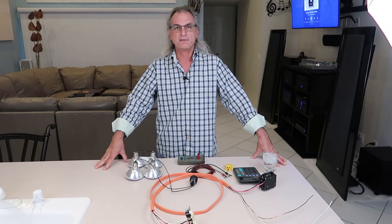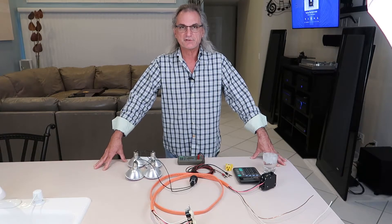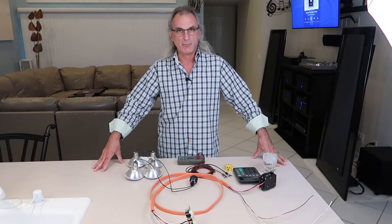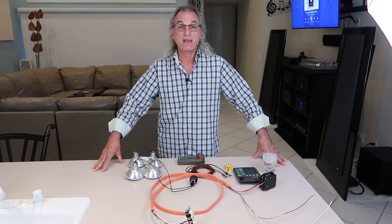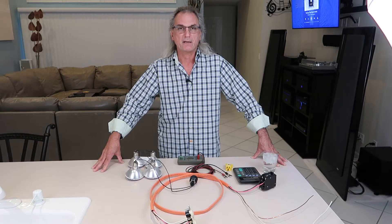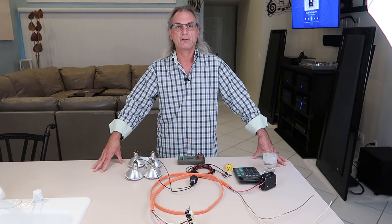I hope this video helps somebody. As I said, I could not find this on YouTube anywhere. For anyone who decides to use a dual voltage outlet: do your voltage drop calculation using the 110/115/120/125-volt criteria, because your voltage drop is going to be double at 125 volts what it would be at 250. I have 90-foot runs and I did my voltage drop calculations using the 125-volt criteria — my percentage drop is 2.4% with 10-gauge wire.